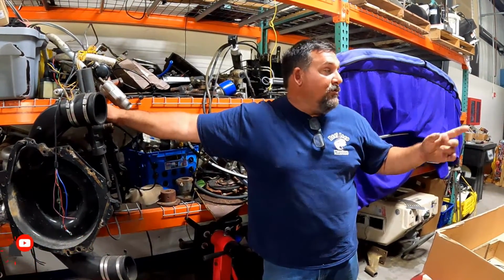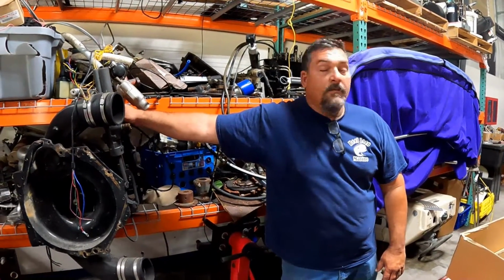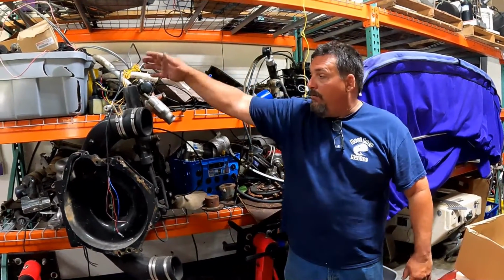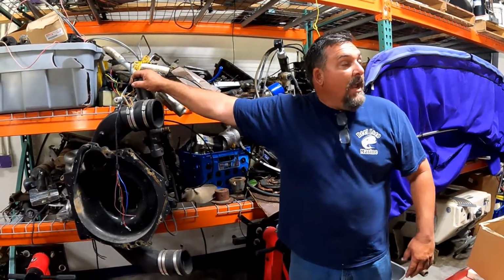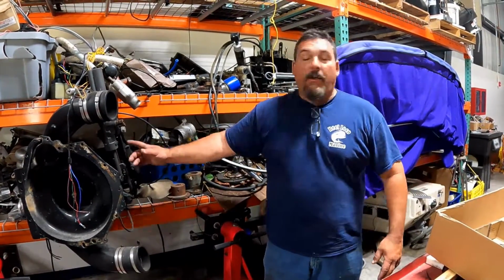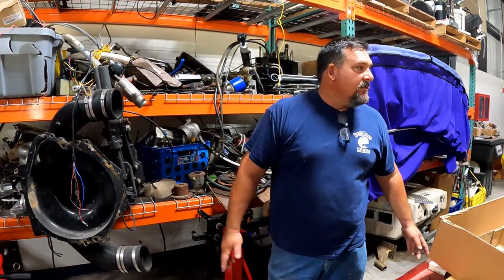So when it's stern drives, it comes like this. Inboards is different. Inboards actually use a ram just like the outboards. So that cable runs all the way back to the transom, from the steering wheel, into the boat, to the side of the boat, into this ram. And then your hoses that you just saw, right. So as soon as you run the engine, you got power. As soon as you start moving the fluid, it automatically helps you. All it is, is an assist.